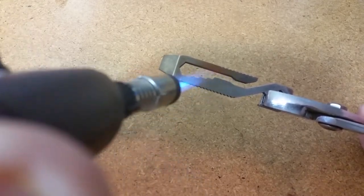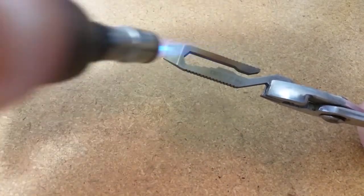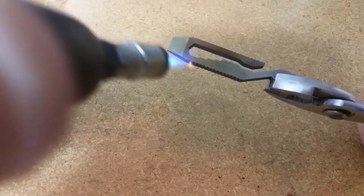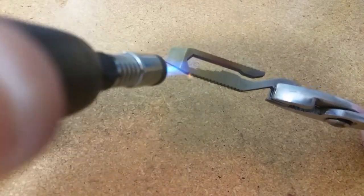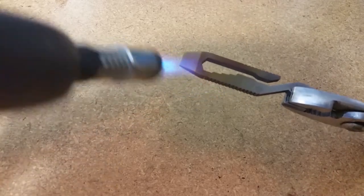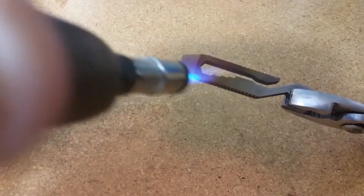Some torches are a lot hotter than mine and get it done quicker. If you see any flame jumping up, that means something dirty is on the material — some particle or contamination catching fire. You can see right there at the bottom there's something heating up, probably where it's scratched. I'm not worried about that here, but right now I'm focusing heat at the top to get color jumping out — and here we go, really jumping out with purple, and blue is about to come.